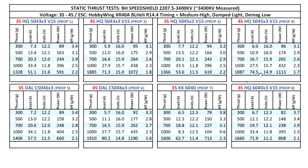So it looks like it's getting to the limit of the capability of the motor to spin faster on the thrust stand. Of course, when you're flying, as the prop unloads, there'll be a difference, because the props are going to be unloaded. So the higher pitch is going to come into play, and you'll be able to feel it once in the air. It should pull better.